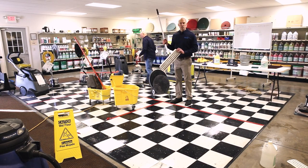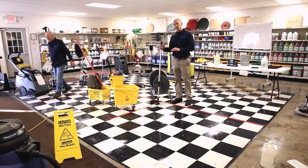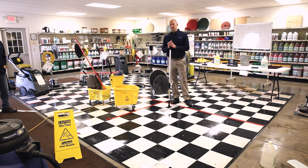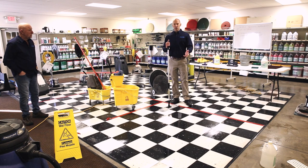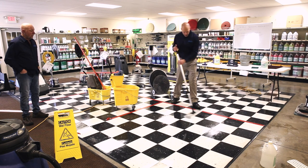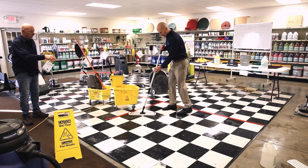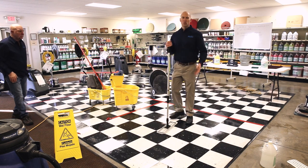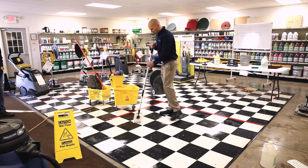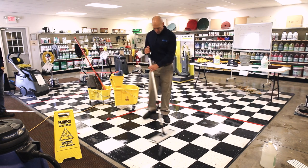Being overly detailed, I'm going to use a microfiber flat mop over the floor that we already flood rinsed with clean water — just clean water with the flat mop — to make sure there's not a hair or fiber left on the floor. I've seen hairs five or ten layers underneath the finish, and even a band-aid that people overlooked. A microfiber is going to pick up ten times as much and almost acts like a magnet with all those interwoven fibers — that's why I choose a microfiber flat mop rather than a cotton string mop; it gives you a much better rinse job.